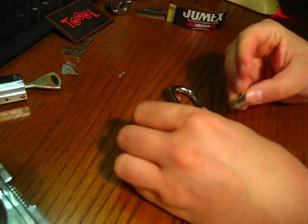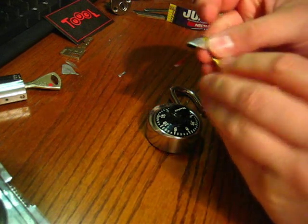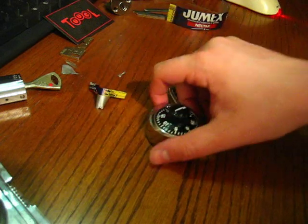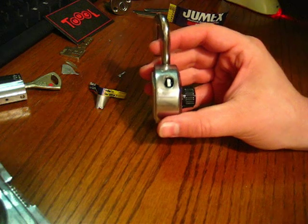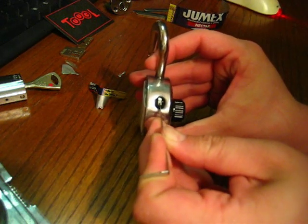You can't see very well around my hands here, but there you go — it got sunk in, it was able to get that bar out of the way, and it chewed the hell out of the shim. You're not going to be using that again. In the past, you may have seen that you can shim some of these locks open and the shim is ready to go again for another attempt. Not the case with an anti-shim padlock.